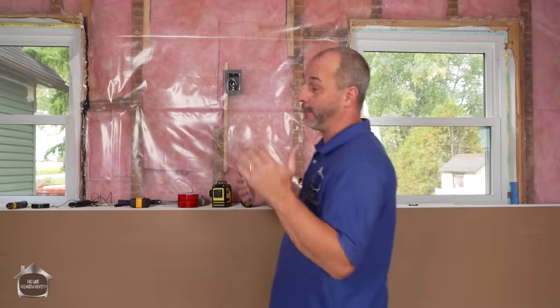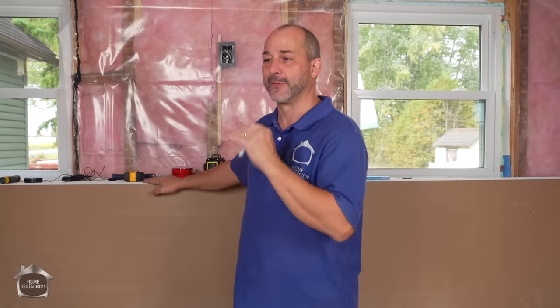Okay, so as I mentioned, I'm working in my kitchen, but let's just talk about a few other things that are really important because this information is useful no matter where you're working in your house. There are a variety of different drywalls in the market. Traditionally, we use what we call half-inch, standard, regular, ultralight. All these different terms are the same thing. There's a half-inch basic drywall. That's for residential construction, whenever there's no requirement by building code for fire safety or water or moisture control. So most of the house is going to get that half-inch.